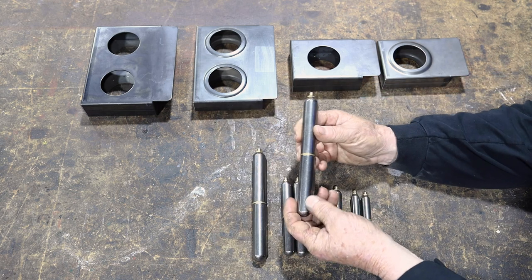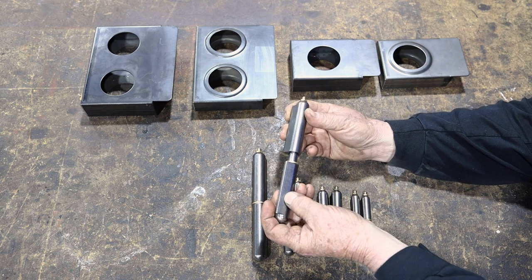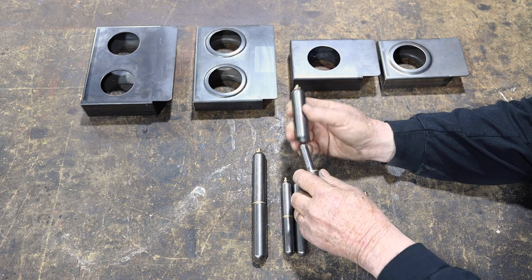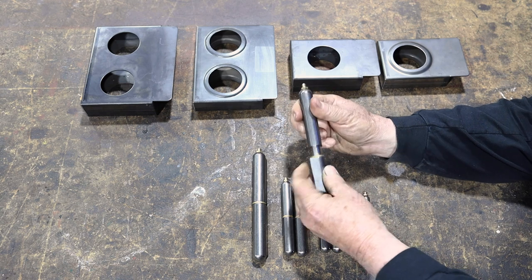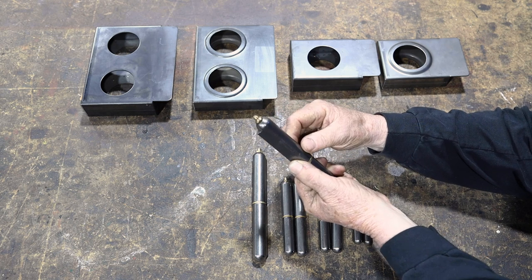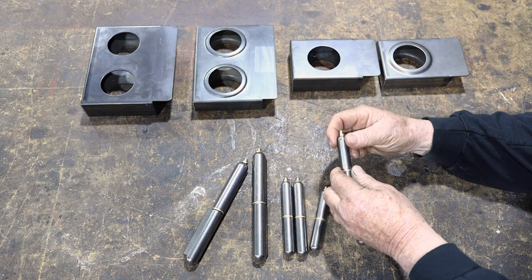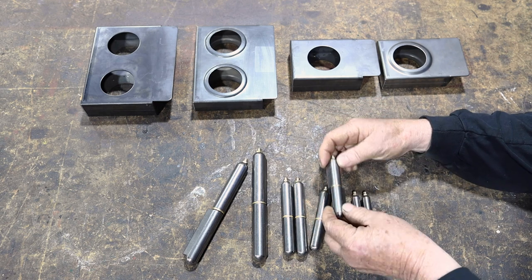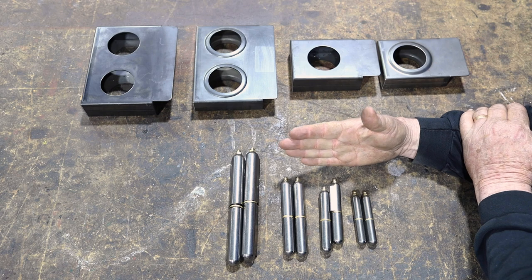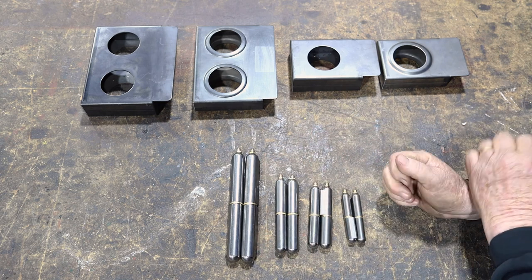You can see the different sizes for different applications — that's what I like about them. This is the bigger one right here, and what I like about it is how easy they are to install. They've got a thickened edge on both sides of the hinge — one side gets welded to the gate, the other side gets welded to the post. They've got a nice brass bushing in here so it rides and pivots nice and easily, as well as a greaser on top to keep everything lubricated. It's a pretty good size pin. I've been using these for years now and I'm exclusively using these hinges — I find they work the best for me. Overall, they're just great products, especially when you're building gates.